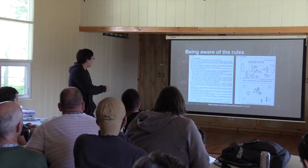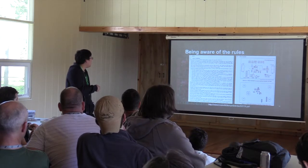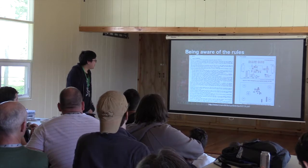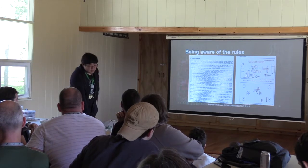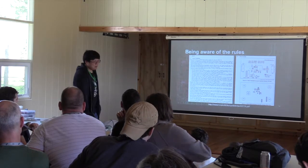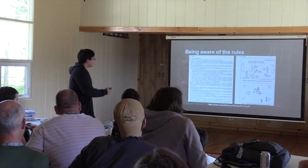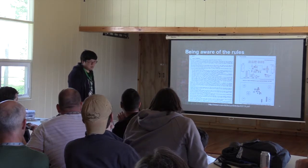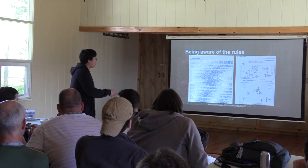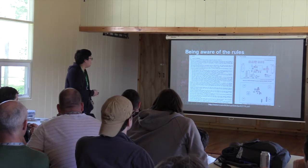So there's all this stuff in data sheets, really good stuff. Like, hey, make sure your inductors are close, make sure your capacitors are close. It's amazing, because a lot of the boards that I look at at work exactly copy the reference design, and it's like, wow. It's not that the designers were not creative, it's just that it saves so much time and avoids so many problems, just sticking with the reference layout.